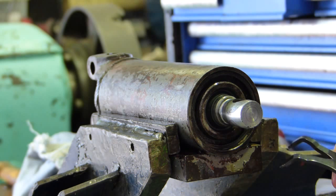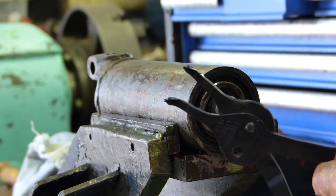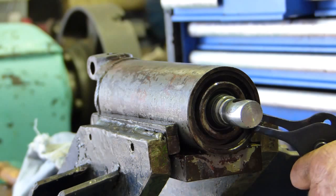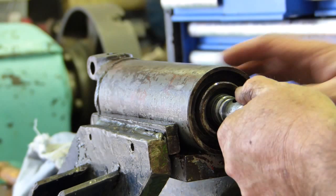In the front there's a circlip, and to get it out we've got our circlip pliers. When you're using circlip pliers, use the biggest ones that will do the job. If you're too lazy and grab the little ones with tiny points, it won't be long before the points are broken off and you won't even have a good set of pliers — they'll just be rubbish. So use the biggest set you have, and pull the circlip out.